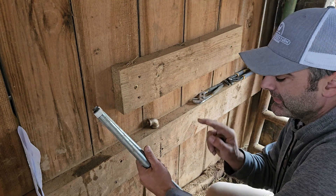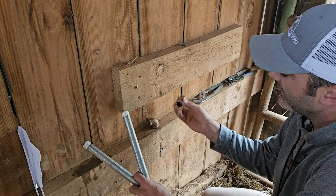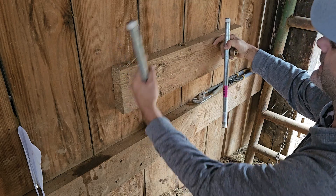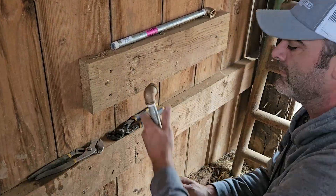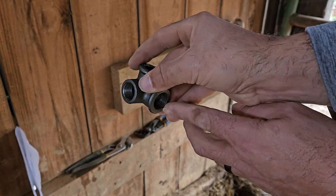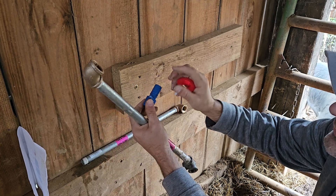We've got our first connections to make here. I have the two 18 inch pipes that I took off the wall — these are 18 inch, half inch galvanized pipes, so half inch MPT on each end. I've gone ahead and replaced the Teflon tape and cleaned up all the fittings that we took off. Now we have a couple of brass half inch MPT to three quarter inch MPT brass 90 degree elbows. On each pipe we're going to put one of these right on the top so the water line can come in this way and exit the same way it came in. On the incoming pipe I have what they call a three-way elbow — again this is half inch MPT. Pipe coming in, pipe coming out, and right here is going to be the pig watering nipple. We're using three quarter inch male MPT to three quarter inch poly line.